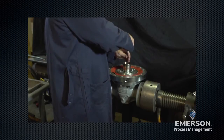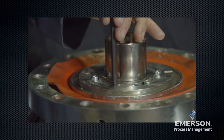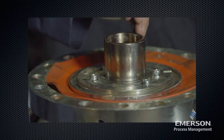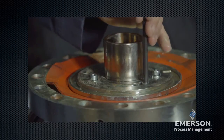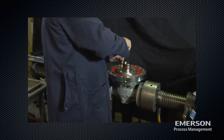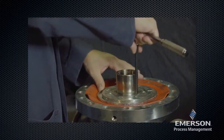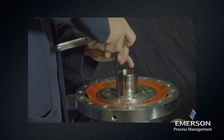When tightening fasteners arranged in a circular pattern, alternate the tightening of each fastener with the fastener directly across from it using a star criss-cross pattern for five times until the proper specified torque is achieved. Each time around, when all screws are tightened to the required torque, the diaphragm will compress a little until the plates are in direct metal-to-metal contact. It will take at least five times around before this happens. Only then will the applied torque on each screw remain at the required value.